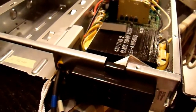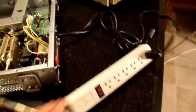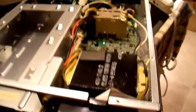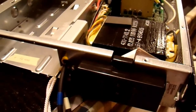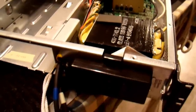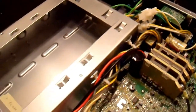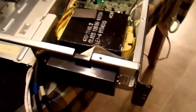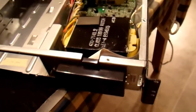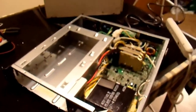If you turn the unit off by hitting the off button, it is not actually off at that point. Turn it off, come over here, unplug it from the wall, turn off the power strip — it doesn't make any noise anymore and has all appearances of being off, but it is not. You have to press and hold the off button and it'll click one more time. Now it is off, but all the capacitors inside are still charged up to full battery voltage. As long as you do this within the next hour or so they will hold enough charge to power the unit up once. So now we can disconnect the battery, pull it out, and haul this over to the computer — plug it into the wall and turn it on without needing a battery at all.